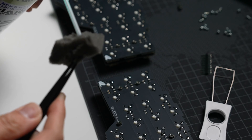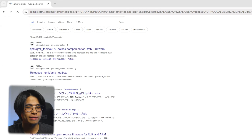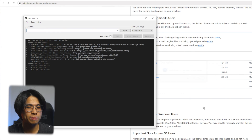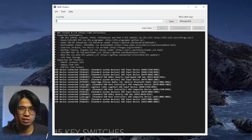Good job if you have followed along this far. The next few steps are simply assembling the rest of the keyboard. I wanted to test whether I made any mistakes with my soldering, so we will test out a default firmware using software called QMK. Head to your computer, preferably a Windows machine. Download QMK Toolbox from GitHub — look for the latest release, download and install the application. Fire up QMK Toolbox and you'll be greeted with a black terminal. Connect your controller to your PC with a wired cable and you should get a notification that a device is connected, along with a COM port appearing in the bottom right corner.